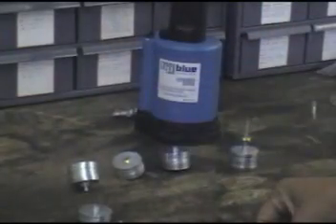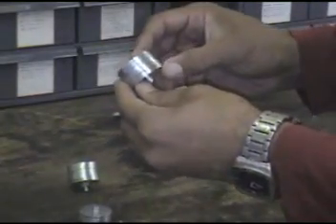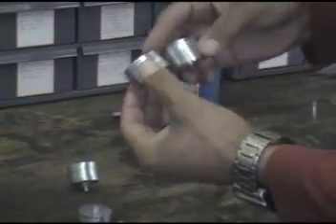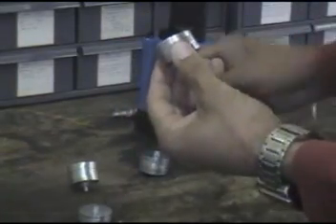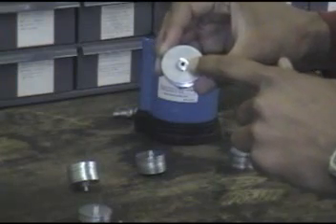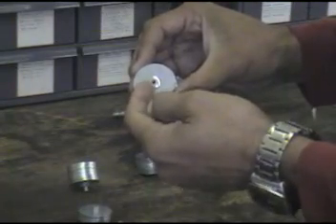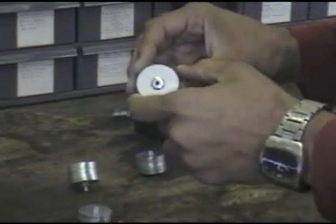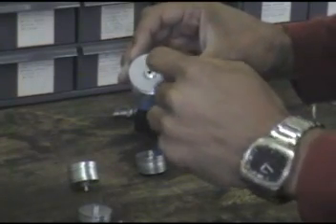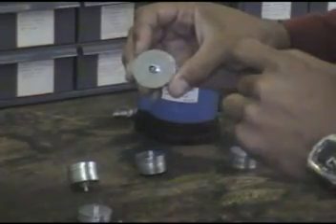Let's take a quick look at a non-structural rivet. Here's a non-structural rivet that has a wider grip range — this particular rivet is a quarter-inch rivet. It's got a fairly significant grip range, though not quite as wide as the Orlok rivet. However, there is no pin retention here and there are no structural properties to the rivet. It's essentially just the shell of the rivet that provides the shear and tensile properties, so there's no extra strength from the pin running down the middle.